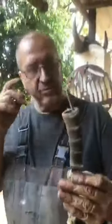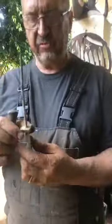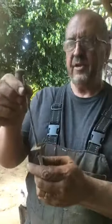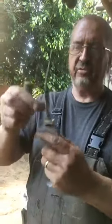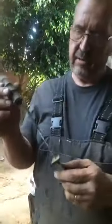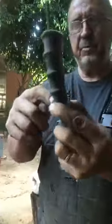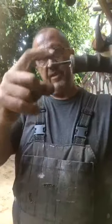I'm talking about how to use horn for a knife handle, and preparation is key. You've got to make sure your bolster is on first. In this case it was all the more important because my tang is only 4mm wide on this little utility knife, yet my threaded rod is 6mm — so you can't weld that on and then put your bolster on because it won't fit over the top. So you first got to get your bolster on, weld on your threaded rod, cut your piece of horn, grind it flush, and make sure it's sitting flush so you can put spacers in front if you want.